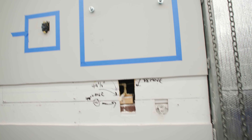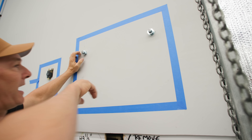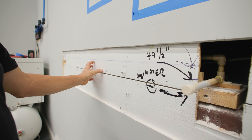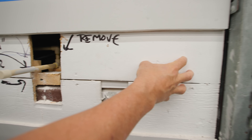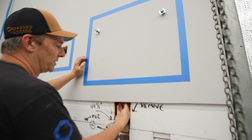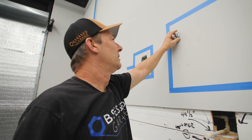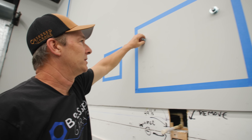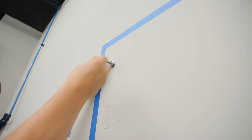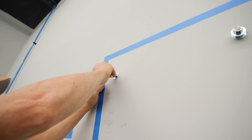So this is where I'm at. The pressure washer hangs in here. There are two key holes on the backside of the pressure washer. What I did is I got half-inch bolts. When I was cutting this plumbing apart to move the hose bib — because it's actually got to go here for the bucket filler — the water is going to come over here to feed DI and feed the pressure washer. I opened this up and there was enough room that I could barely reach my arm up here and put a half-inch bolt through, then nutted it with a washer and double-nutted it. So the pressure washer will hang on these bolts and I feel comfortable with this — it's going to be sturdy.